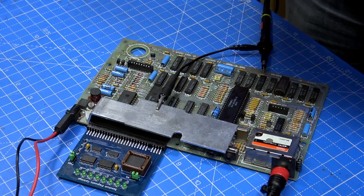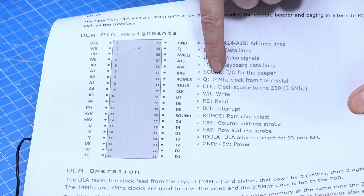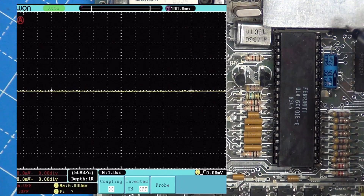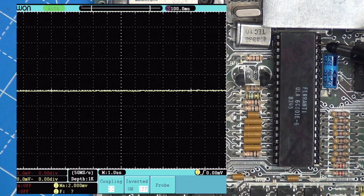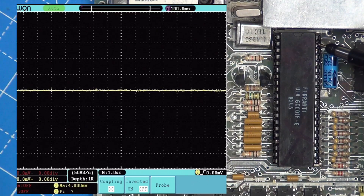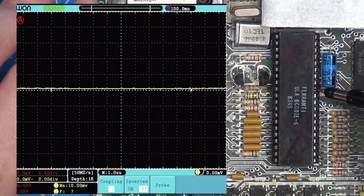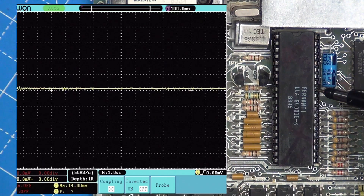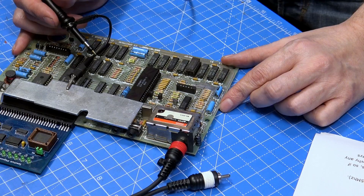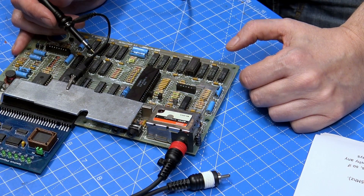So I think what we should do now is have a look at some of the most common pins on the ULA. I've got my pin out here, which comes from Dean's website, Breaking to Program. We should have a 14 MHz clock coming in to the ULA, and then that is divided down to give us the 3.5 MHz for the CPU. Now I'm going to connect up to pin 39, which is labelled as Q — the clock coming in. And you can see there on the scope that it does do something, but we basically have no clock coming in. If we look at CLK, which is pin 32, this will be the clock that goes out to the processor — it should be 3.5 MHz. And you can basically see that we have no clock going to the processor. Our debug lights are not doing anything as well. That says to me that there's something wrong with the ULA.